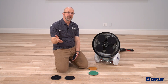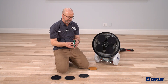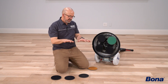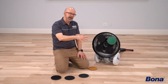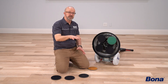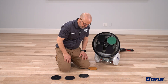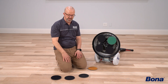Steel plates also prevent any kind of dish out whatsoever, keeping your floor completely flat. We'll always use them in conjunction with a quarter-inch intermediate pad. Your abrasive goes directly on the steel plate, that goes to your intermediate pad, and then your intermediate pad goes on your power drive. That gives you a little bit of a floating system too, so it doesn't make it so stiff that if you come to a high spot in the floor you're going to get a big bounce. With a super stiff system it's going to really jump up on that high spot and the machine's going to be shaking and rattling, which may put some scratches off the high spot that you don't want. Soften it up a little with your quarter-inch intermediate pad, but utilize those steel plates - they can do nothing but good for you.